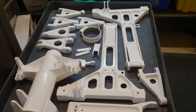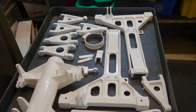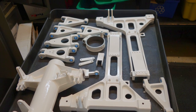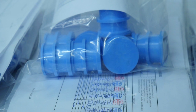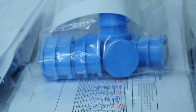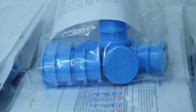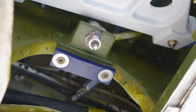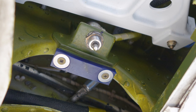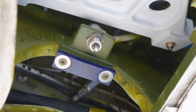There's another point — we actually have a separate video on it — but that is the wing fuel doesn't cause the wing to drop. When you fuel an empty wing on an Aerostar that's been equipped with the Marsh Brothers kit, the wing doesn't drop. I've had it happen once in 400 hours, but I would consider that an anomaly — it only happened once. You can still bump the wings up if you want to add fuel as you used to do, and it's no more difficult to bump it up than it used to be.